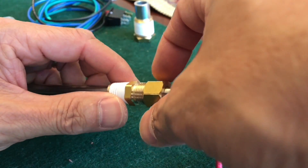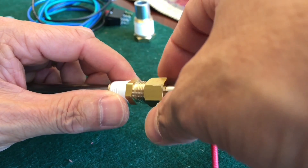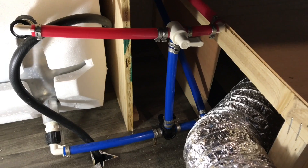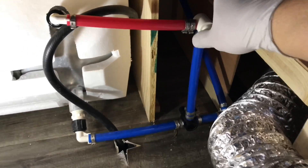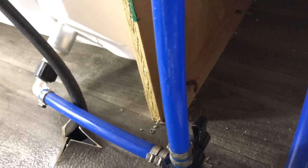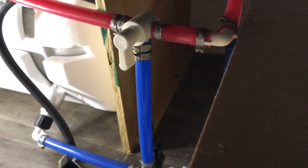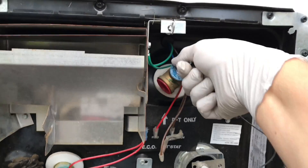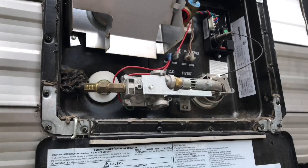All prepped up and ready to go. Partially assemble your heater cartridge — just right there, using the heater cartridge as a guide. We'll tighten that up later. Isolate your water tank by turning the valve clockwise, and also the one below — clockwise is the off position. Let's go outside, drain it, open the valve just like that, and leave it open. Let's go with a socket.